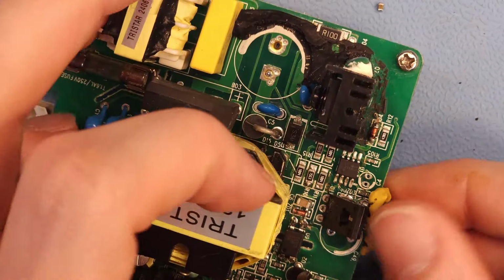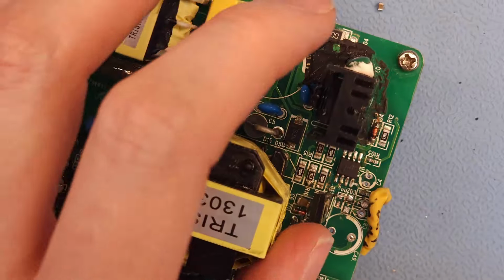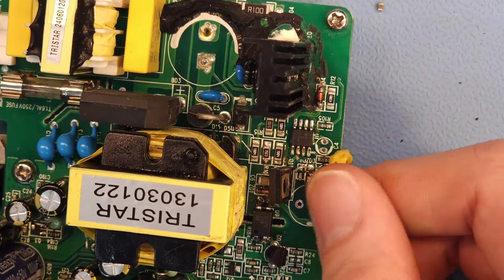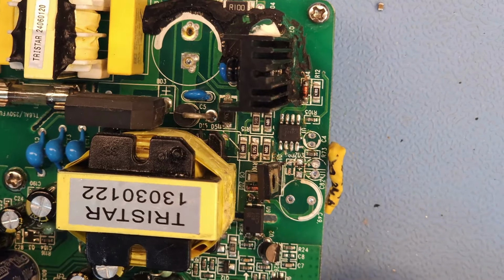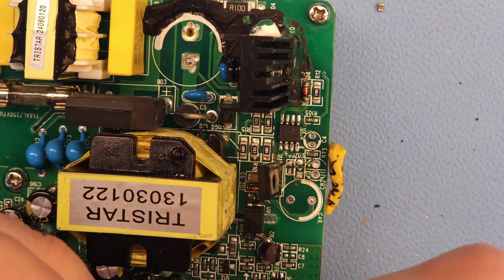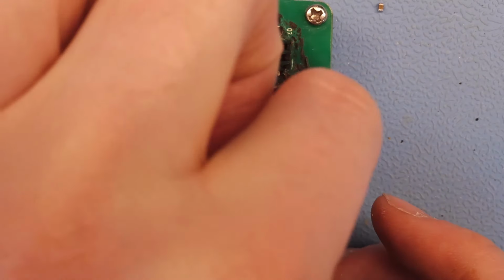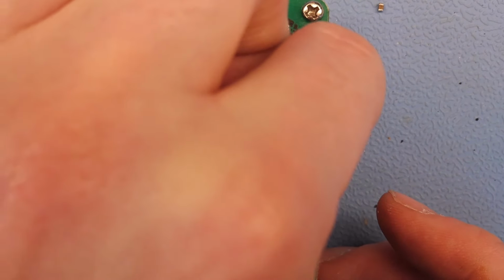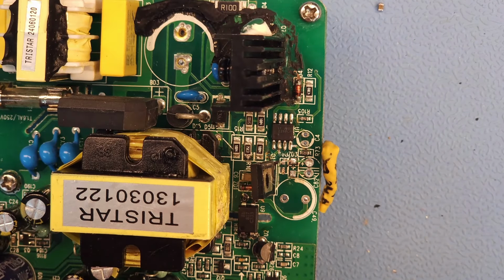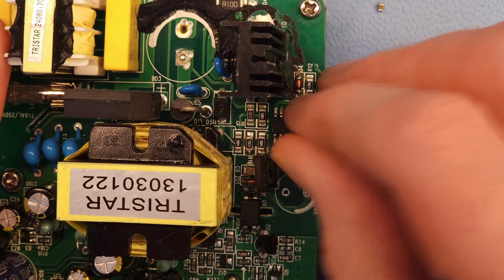Okay, what's next? Probably should fold this transistor up again. Next is these three capacitors. That's the only things that we have still left to do. Where is my capacitor? So this is the 3.3 microfarad one, which I replaced earlier. So I'm just going to put that one back. I have already cleaned the holes here for this, so it should fit in. Famous last words. Oh yeah, it does. Okay.